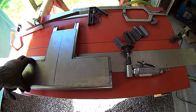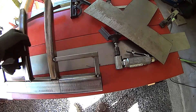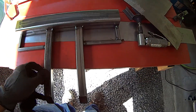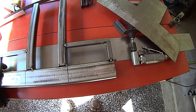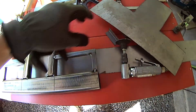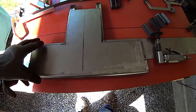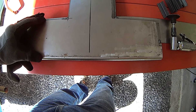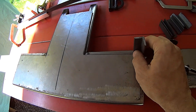There's a little tubular chassis here — this is some one-inch square stock, this is some half-inch square stock, this is some two-inch square stock. I'm going to build a three-inch wall all the way around this, and before I do that I wanted to make a floor. I stopped early on this piece — it's small all the way around on purpose, so these pieces can go on here.